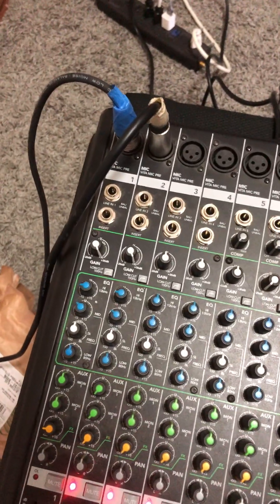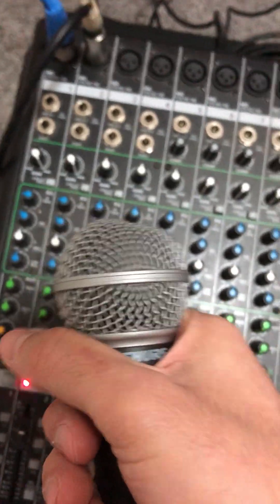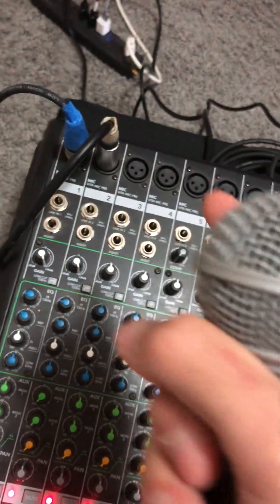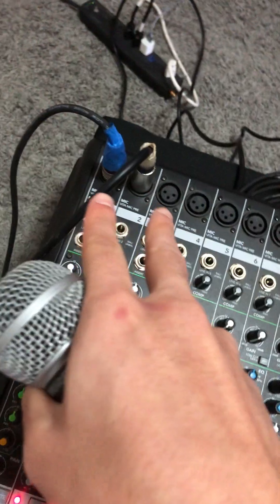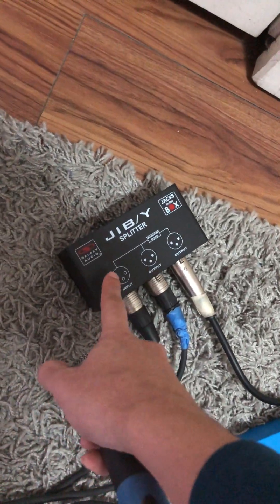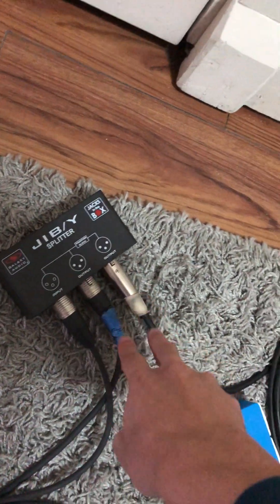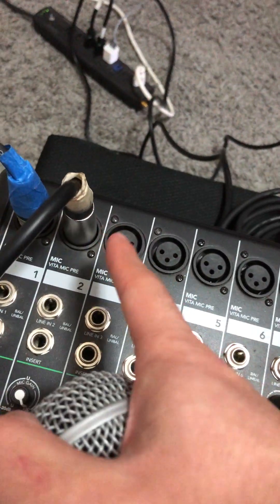What we want to do is make sure we can get this same microphone to send a signal to the recording while not going through the PA — so we want it to split. What I did here is I took the microphone and put it into this XLR splitter, so now the input is being split into two outputs. These two outputs go all the way over here: the blue one goes to PA, the white one is going to just the recording.